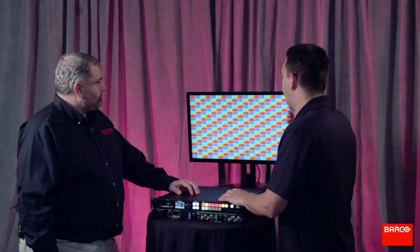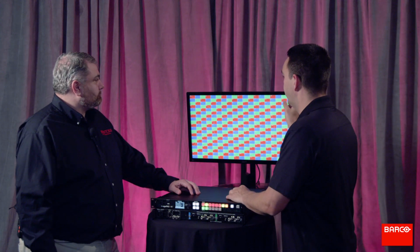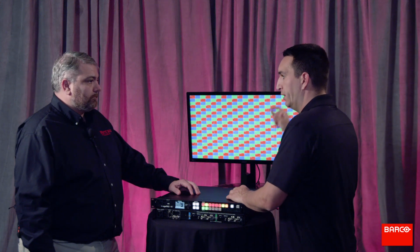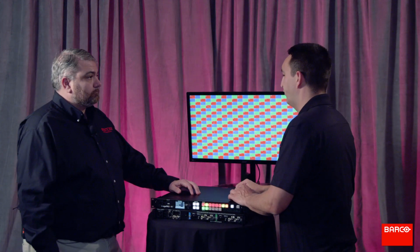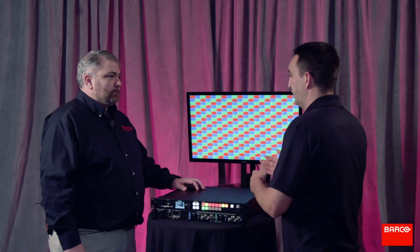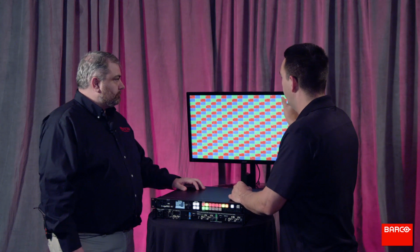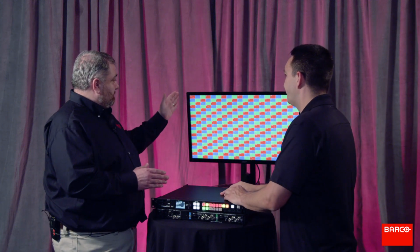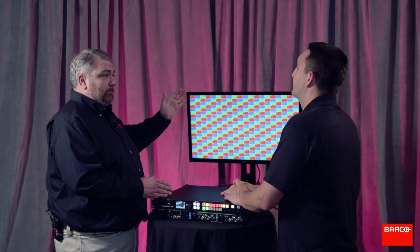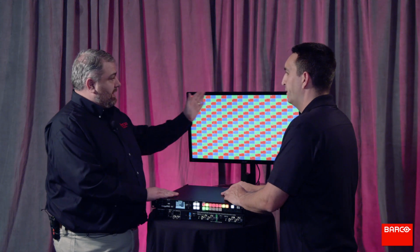These squares. And now this grid is basically a representation of your wall panels in their own specific pixel width and height. So it can dial in our actual grid spacing. So say if I have a wall that's like 168 by 168 or 192 by 192, I would dial that in on my grid spacing, and my actual physical output would represent that. So it's like a dynamic grid. So these are pixel accurate representations of what the LED tile would be. So as long as I'm making sure pixel for pixel, and I can adjust that in here, then we'll actually have a grid for the wall.